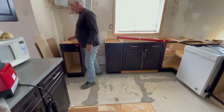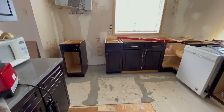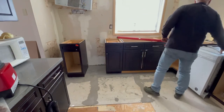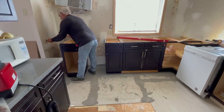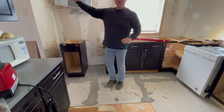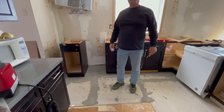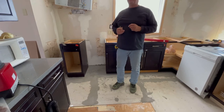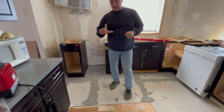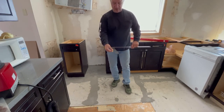This is a 15-inch cabinet. So the 30-inch stove and a 15-inch cabinet, in simple mathematics, is 45 inches. One of the caveats when you've got a wall darting out is you want to see which way it's square. If it's perfectly square, that's not a problem. If your wall is shooting outward — more of an obtuse angle — that's not going to be a problem either.